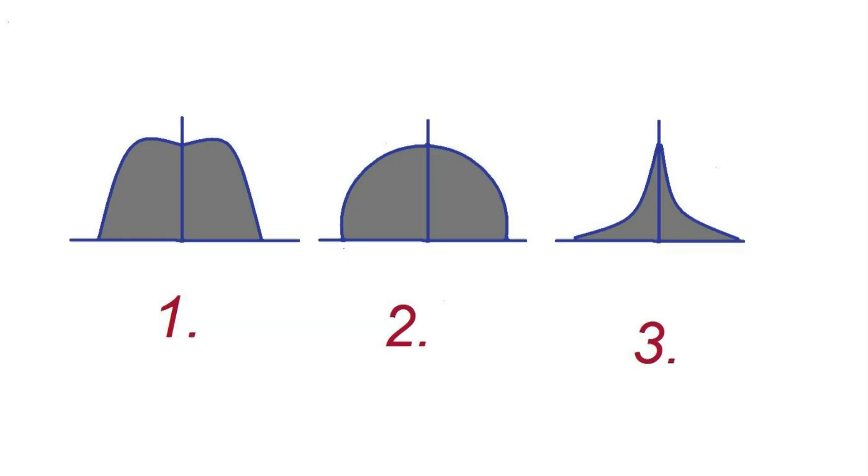Take a good look at the picture — which solder join is the most sound: one, two, or three? The answer is three. Number one is a dry solder join that hasn't fused — the crater on top is a dead giveaway. Number two has had too much solder and may not have had enough heat to fuse properly. Number three shows that the solder has willingly flowed and fused to both the board and the component.